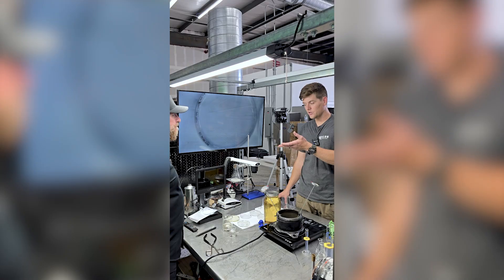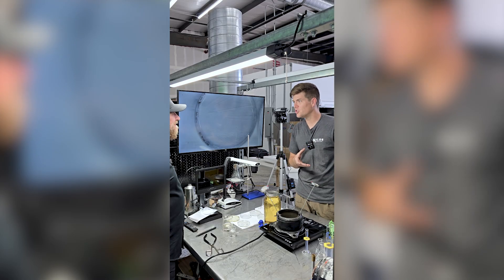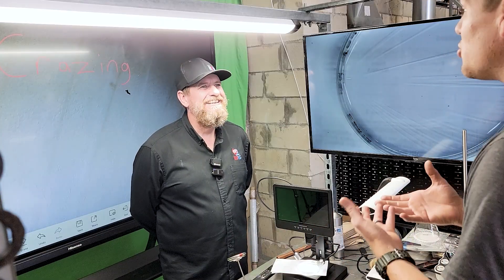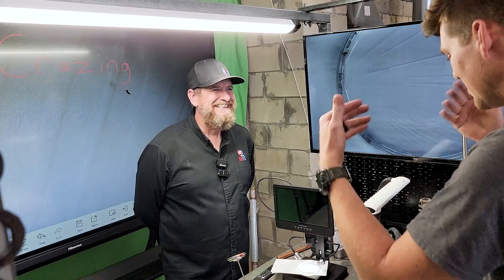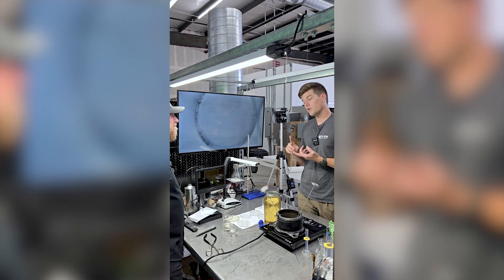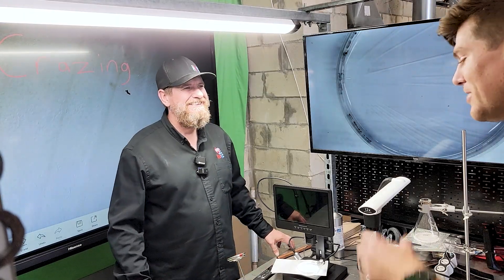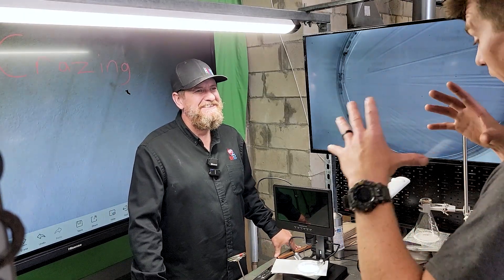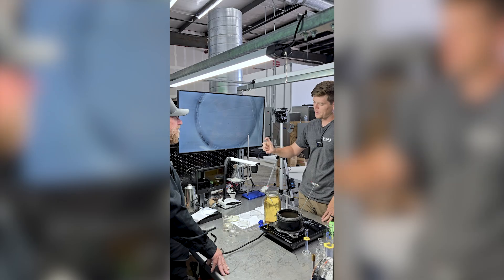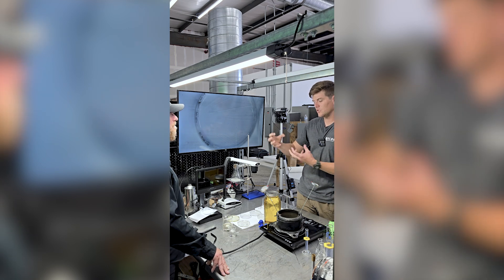This takes me back to cleaning kitchen equipment on the roof — when a package unit is too close to a grease hood blowing into the outdoor heat exchanger. You go to wash it with a water hose and the dirt will not come off because of the amount of oil caked up over time. This brings us back to using coil cleaners — degreasers — but understanding and actually reading the instructions. Someone the other day was saying to clean your electronic expansion valves with a specific rust inhibitor, and I thought, 'wait, what's in the spray?' There's chlorides in it.